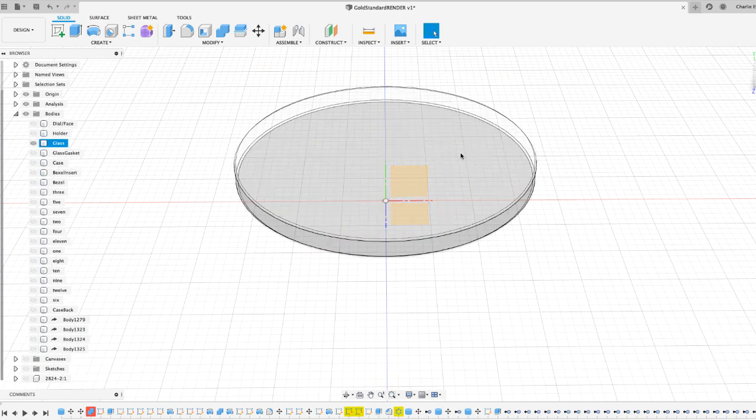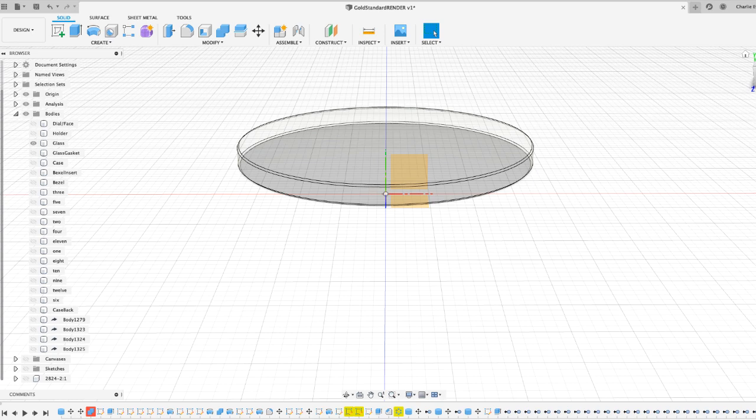So we'll start with the glass. As I mentioned last time, it's double dome sapphire crystal. As you'll notice as well, there is a beveled edge on the glass, and that's a bit of foresight with regards to the assembly process. When you're squeezing glass into the case with some pretty tight gaskets, it makes that process a little bit easier and you don't endanger the glass quite as much. Costs a little bit more, but I think we'll probably save on broken sapphires by using this method.